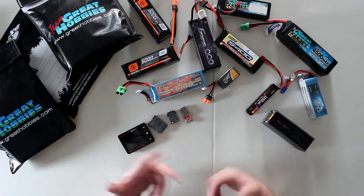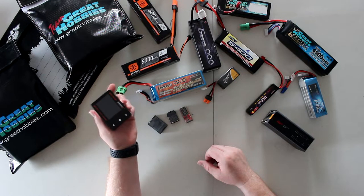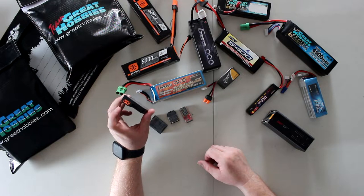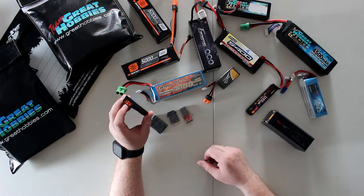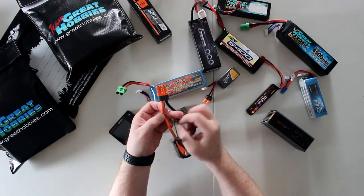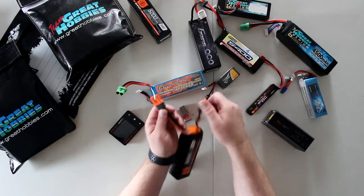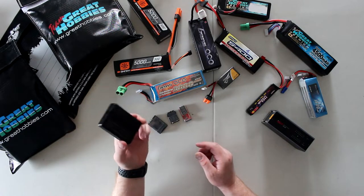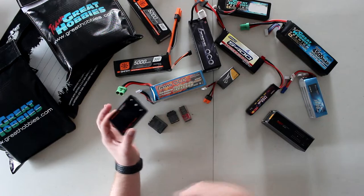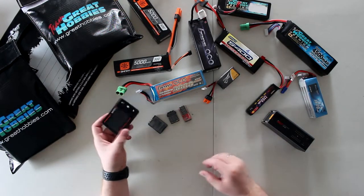I have a 1200 and 1100 charger. I can do it with those. Or you can use the Spektrum LiPo smart tester. This tester — I do have a video on it — does multiple things. You can test your cells directly by the balancing port or even with the main power. In the main power of the smart batteries, you'll have the middle pin. This little gray wire talks to the chip and talks to any smart batteries or smart ESC. You can program the chip saying, okay, I want you to store yourself starting at 24 hours, or put yourself in storage mode at 195 hours — so on and so on. It's up to you.